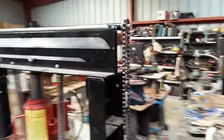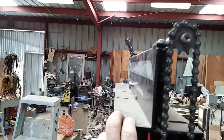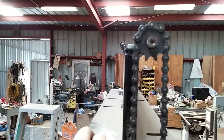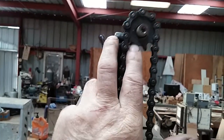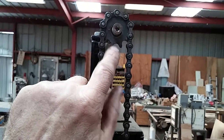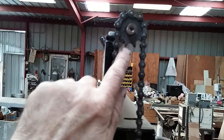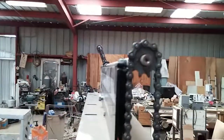It's got a mount on the top and a rod. I only had one sprocket, so what I did is I took a hole saw and cut a piece of plate. Then I put both the sprocket I had and the plate I just cut on a shaft. I used transfer punches to punch where to drill, and I actually made the sprocket right here — drilled holes, cut it out with a hole saw, then hand-ground everything down. It actually worked pretty good; it's not turning really fast.